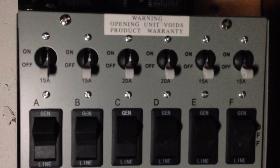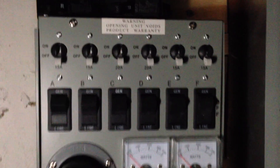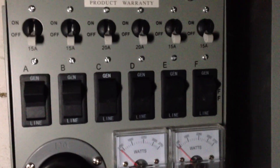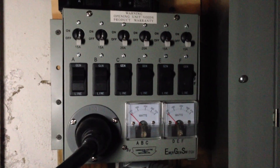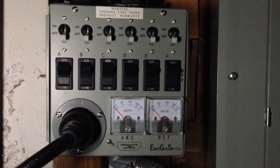I think it's been five minutes, so the generator's fully warmed up. I'm going to switch the load on, then come back down here and load up the house. By the way, here's what I've loaded: the refrigerator is on circuit C, which is a 20-amp circuit, and the furnace is on circuit E. I'm only powering critical stuff and where the family's going to hang out.